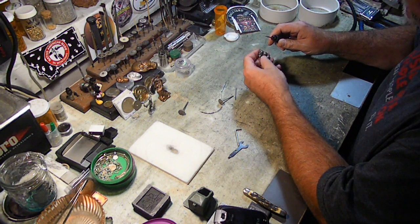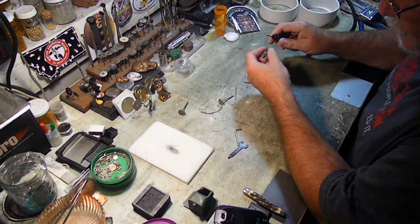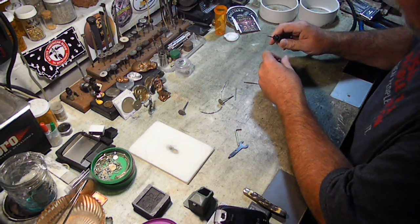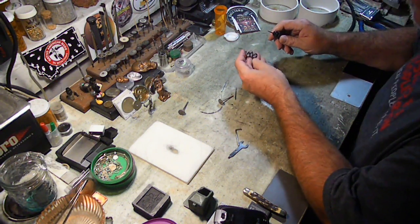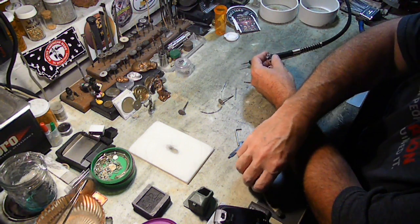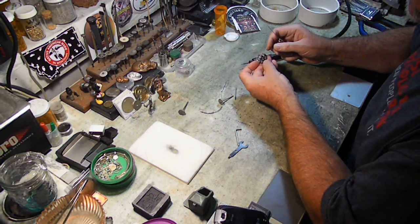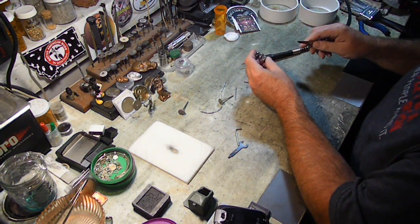Okay guys, so we did our pewter pour. You saw I packed the mold, or I actually didn't show you packing the mold, but I showed you how I made this. I went outside and poured it, and I don't know what I did, but I screwed something up, and I didn't get the pour on camera. But like I said, you did see me making this part. So I'm going to go through the process of cleaning this up. It is poured out of pewter, so it is fairly easy to work on. Then we are going to use this for our master for our mini BYS 3-skull bar or casting or whatever you choose to call it. So I'm going to continue working on this, and we'll get back at you in a bit.